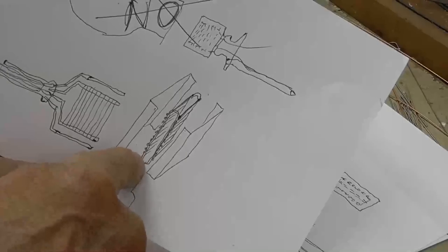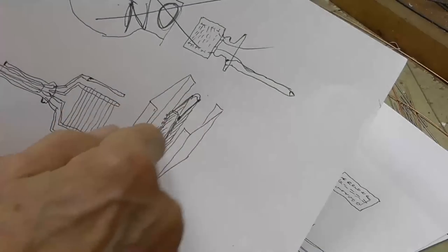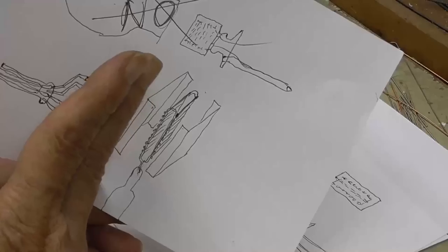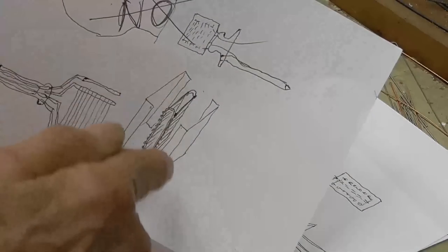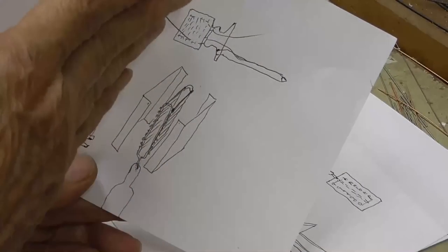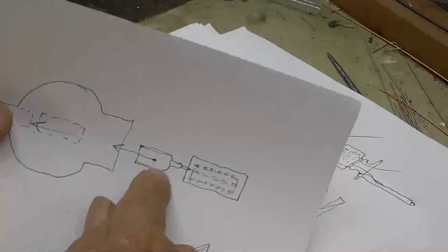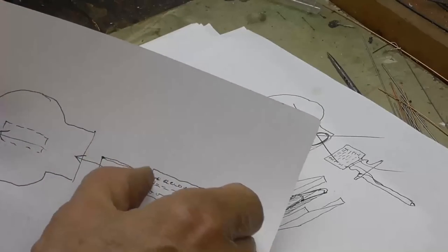We'll take those wires and we'll make a framework on each side, and then we'll weld the grid wires across. Okay, that'll give the spacing of the grid and hold it vertically. Then the two wires that stick out for the plate, we'll take the plate and we'll make it in two troughs like that, and we'll just slip them onto there and weld it at the right spacing. Okay, and that'll give us an assembly that looks like this. We'll have the tube that goes through here, this pinch, and then the grid inside of it and the plate along the outside of it.